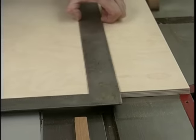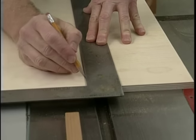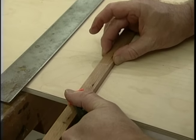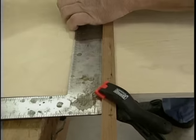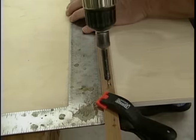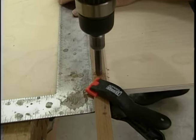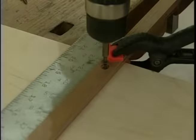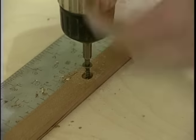Using a framing square, I'll put down my layout line and I'll be ready to attach the runner. I'm positioning the runner on my line with a couple of spring clamps, and I want to take the square once again and slide it up against the back side to make sure it's nice and straight. Then I'll pre-drill for some screws. I'm countersinking these because I don't want the screw to be proud of the runner. A few three-quarter-inch screws will do the job holding it in place.